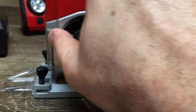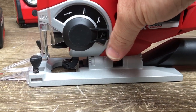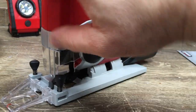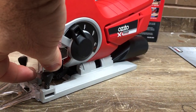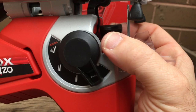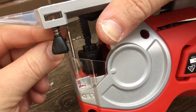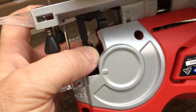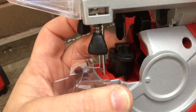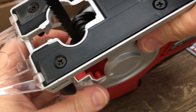One of the biggest benefits is the pendulum setting - the aggressiveness of the cut speed. You can go to the most aggressive, which gives the blade a tilt so it cuts through timber a lot quicker but gives a rougher cut. Or you can go back to the straight up and down motion for a smooth cut. There's a little clear guard that pops up so you can get your fingers in there, and a quick release blade clamp as well. The blade that came with the saw is easy to install - the clamps on either side hold it, and it's definitely not going to come out.